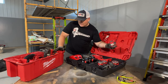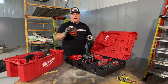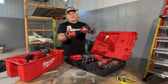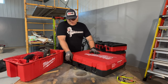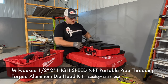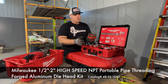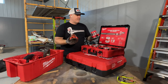Now a couple of things about the dies. These are machined and cast iron both. What you're looking at with a 12R style die head is that these are a very universal style die — they're going to be able to fit your other equipment. This is a different kind of interface, so not the same with the compact threader. Which brings us to the next tool just coming out from Milwaukee.